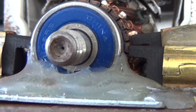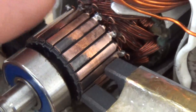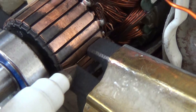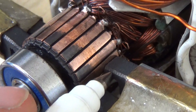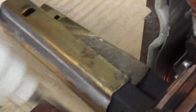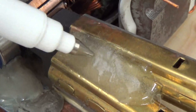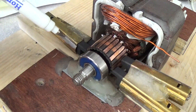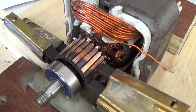They're slightly offset so that when the rotor is turning, just before one brush removes off the commutator, this one connects to that commutator segment — and the same at the back. These two are isolated from each other with epoxy and an air gap between them. So I've made brushes that can be used to collect the flyback, and these are the energizing brushes — I just thought I'd share this design.